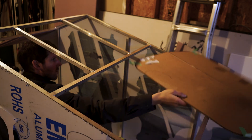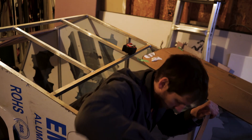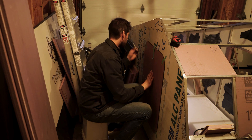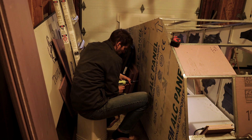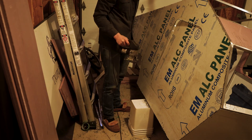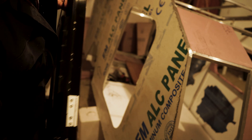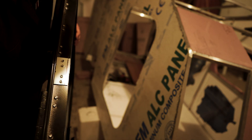I've got my door template, getting it all lined up. I'm gonna drill some pilot holes, go around to the outside, and cut it out with my skill saw. I'm measuring from the bottom to the top drill holes to see how level I'm running. Everything looks good. After cutting the hole out initially, I had to go back and forth with the door a few times, just to make sure the latch on the inside of the frame fit properly. A couple things to note about the Challenger door: they've got these connection plates in the frame. So if you're cutting your cutout quite close, you're gonna have to cut out some more for that.